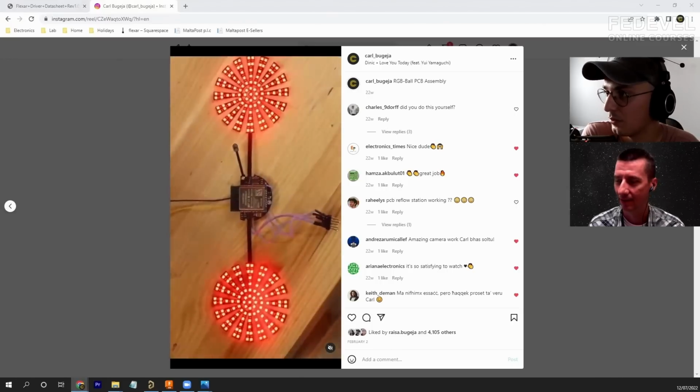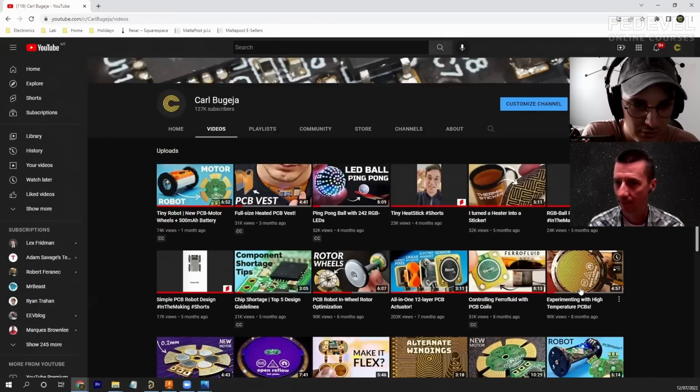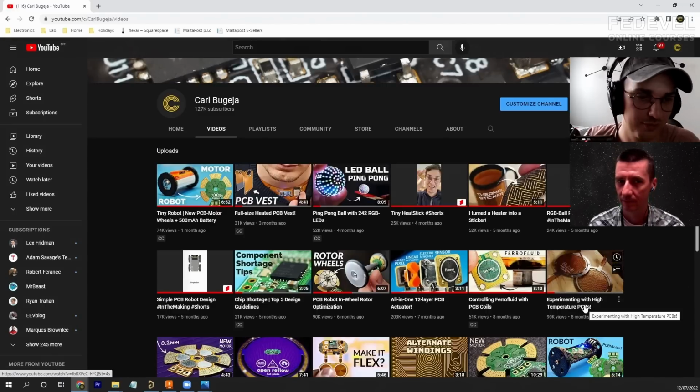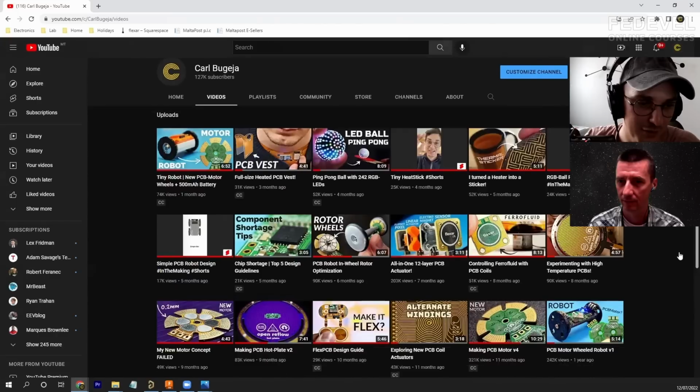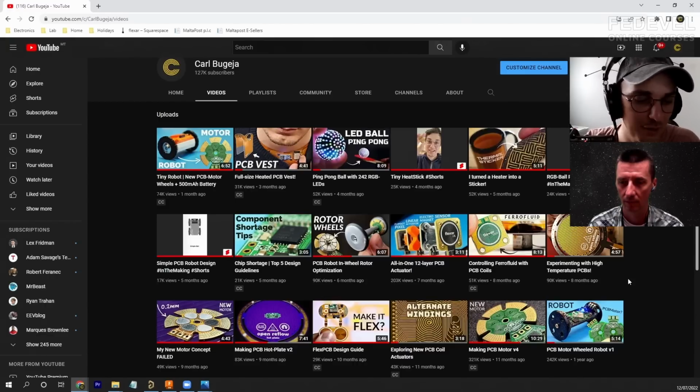Yeah, here it is visible. I have two videos, this and this, regarding temperature testing on flexible PCBs. So here I tried to basically reflow PCBs with a PCB hot plate made from another PCB. I have another project coming up that tries a different technique, because what I found here is that it cannot be reused. For one time, it's powering it at 160 degrees Celsius for 4 minutes or something like that. It should be okay, but it's not reusable. So I have another project coming up where I'm going to test self-reflowing PCBs.